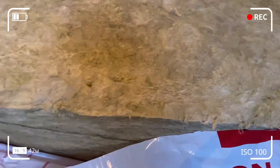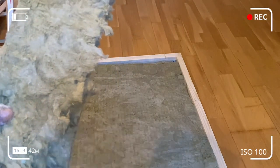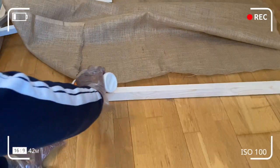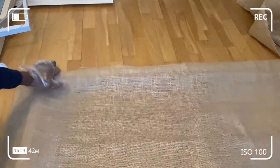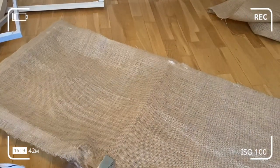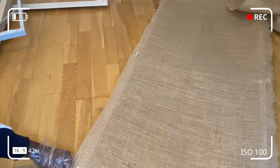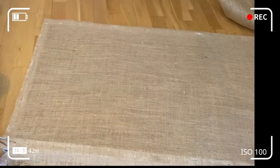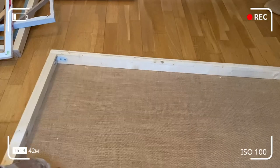Clean out your work area and prep the front fabric and your rock wool insulation slab. Place the rock wool sheet in the assembled backing frame. Cut some flexible rock wool to fill any gaps in the frame if required. Repeat and reproduce the process for other panels. Utilise hand gloves and a face mask when dealing with rock wool. Ensure your work area is well ventilated, and cover exposed skin when working in an unventilated area. We're repeating the process for the other panels, filling gaps where there isn't enough rock wool within the frame and backing.